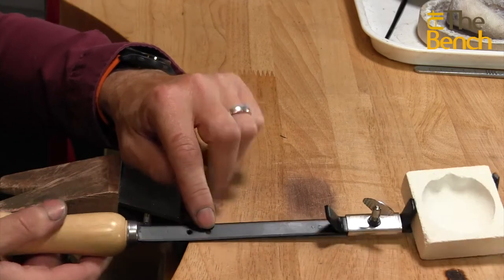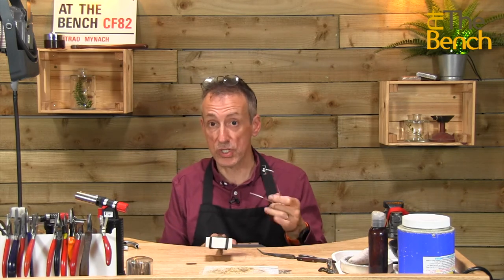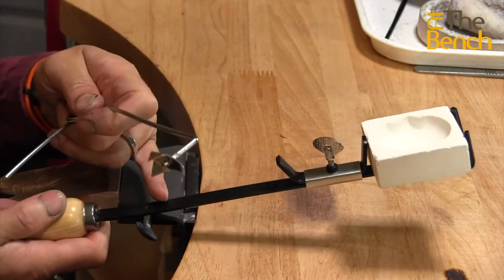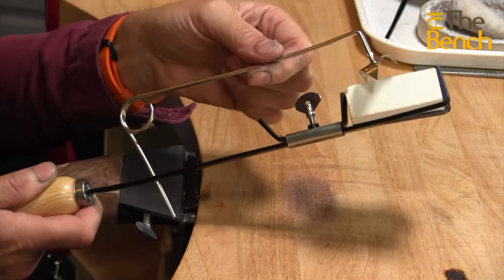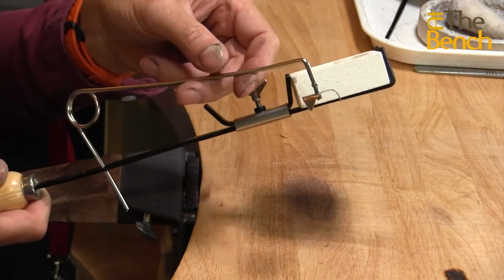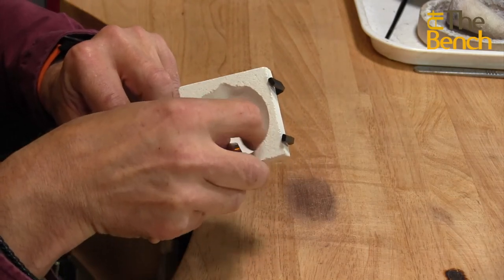You've got two holes down here and this device is quite springy with a little claw on the end. Now if you're unsure about how safe the crucible is, use this - and perhaps always use it just to be on the safe side. The idea is you put this into the hole; this is a two inch crucible so we're going to use the hole nearest the handle. The further you put it down, the greater the tension is going to be.